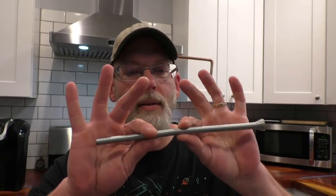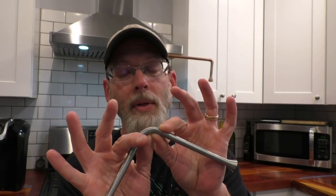Normally if you're going to bend a 90-degree angle in your pipe, you have a real good chance of crimping it, squeezing and pinching it off so nothing can flow through — and then you've got to start over. So get one of these spring benders and go slow, take your time. One important thing to know about copper: copper work hardens. If you work it, bend it, and hammer on it, it gets harder and more brittle. The way to get around that is to anneal it — heat it up with the torch until it's red, then let it cool back down to room temperature. That will soften it back up and make it a lot easier to work. But really, if you're paying attention and taking your time, you won't have to mess with that.